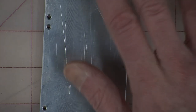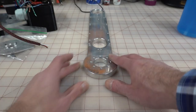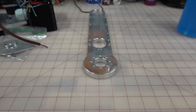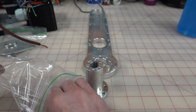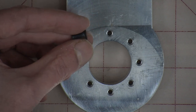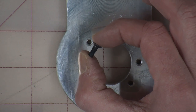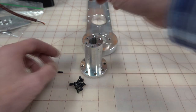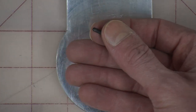We've got our arm oriented in the right direction and now we're going to focus way down here — we're going to be working on the J2 joint. I keep all my stuff bagged up; when I first got all my kits, I sorted everything out so I knew what's what. You're going to need eight M4 by 10 countersunk flathead screws. And remember when you're measuring these screws, you measure the entire length — the whole length is going to be about a centimeter and they're M4s, so about four millimeters thick. You're also going to have a grub screw for later, but this is a good time to dig that out.